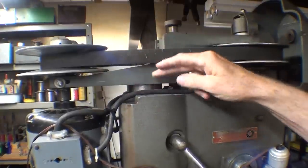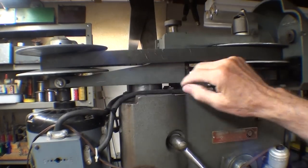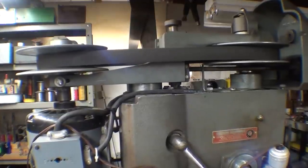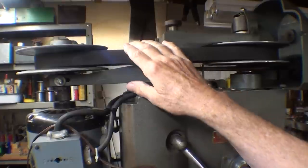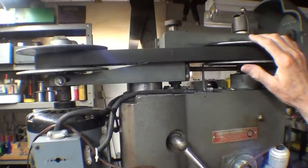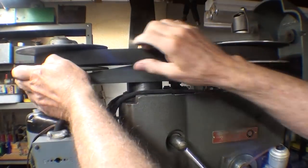I did replace all the wiring, as I told you, with a nice high-quality rubber-coated wire, including the wiring to the Cutler-Hammer switch. Someone said that this is not a lever — I guess I had said it's a lever — it's not; it's a linear actuator, going up and down with no fulcrum. Someone also asked why you can't change the speeds while the machine is not running: it's very clearly marked, but what will happen — and this happened untold times at school — is that the kids would change the speed and jam the belt enough that I'd have to take the cover off and work it free, because the belt becomes jammed and pinched.